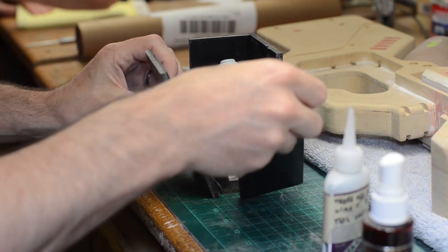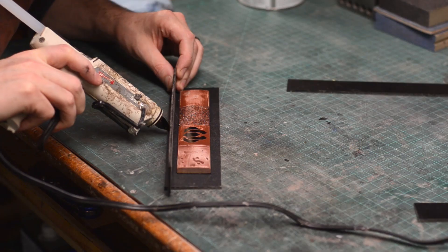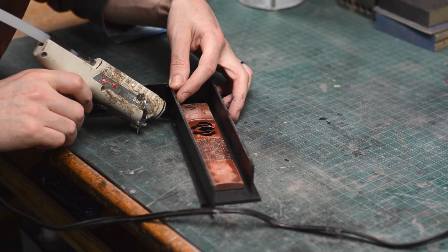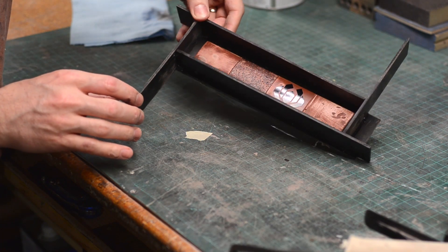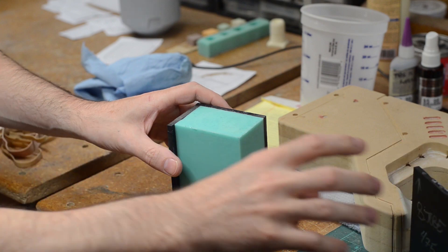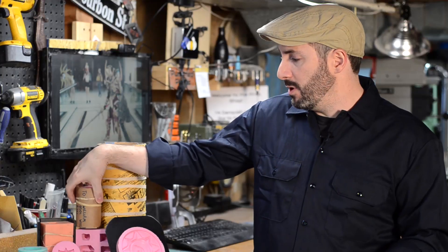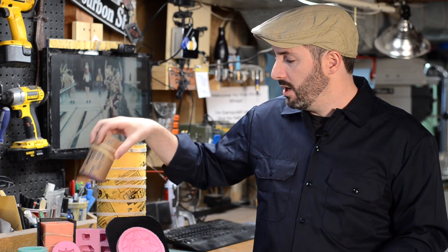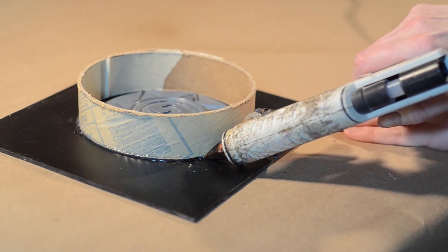Next, you need to build a box around your piece — this will contain the silicone. I like to make sure there's at least a good half inch between the side of my piece and the side of the box, unless it's a really big one. Plastic or cardboard is actually really good. I like these sturdy cardboard tubes from the hardware store, or smaller ones you'd use to hold a poster — those are really good for cylindrical shaped pieces. Those also get hot glued around your piece to the base of your mold box.